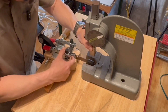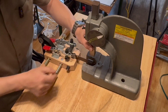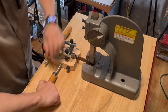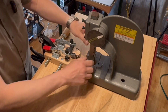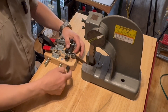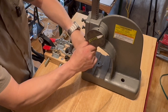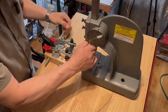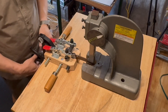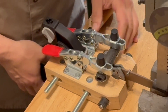What you see me do is make sure that the Axis Lock is not impeded by the clamping device and the knife can unlock freely. This is a critical adjustment because if I didn't allow the knife to unlock freely, lock failure would become impossible, making the test useless. One of my subscribers recommended that I arrest the back of the handle so that it doesn't have any ability to move upwards, and this is what I'm doing here.